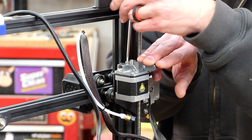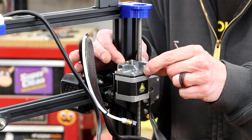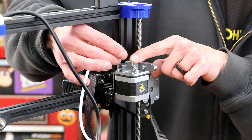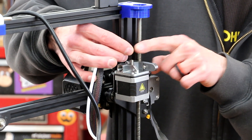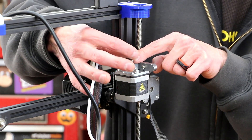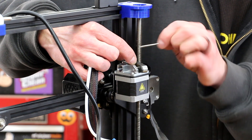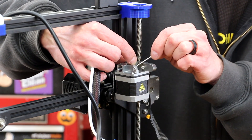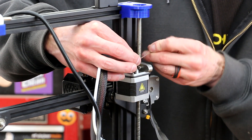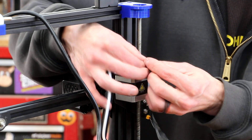Now I'll snug down the guide roller, which helps guide the filament and keep it against the feed gear. And that feed gear is what we need to install next. Don't forget to put this little gear on. When you put this gear on, the stepper motor does have a flat spot on the shaft — you need to make sure one of the set screws lands on that flat spot. That's going to help lock it into place and keep it from rotating. When you're lining up this gear, make sure it's centered with the other bearing-mounted guide roller. These little teeth help grab the filament and drive it through. This little gear has super tiny set screws to hold it in place, so be really careful when tightening — it's going to be really easy to strip out those tiny screws.